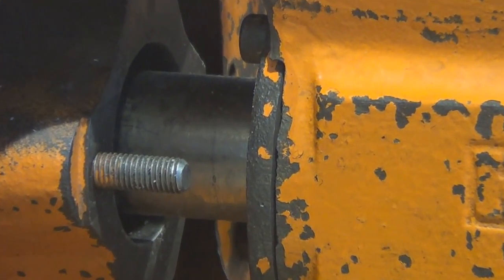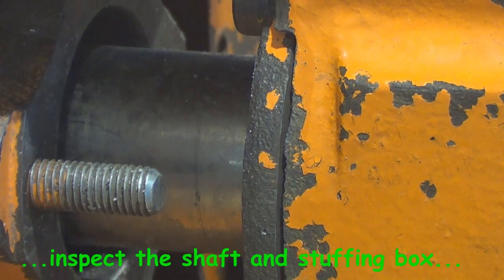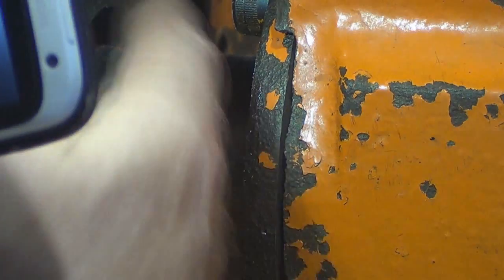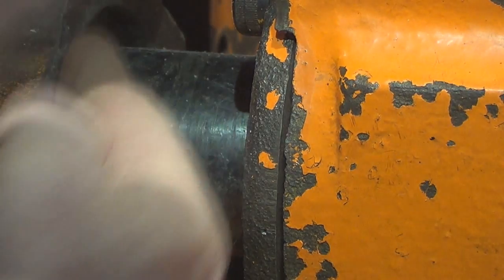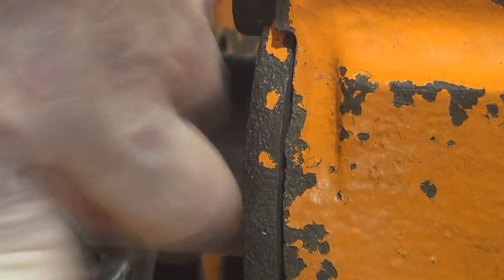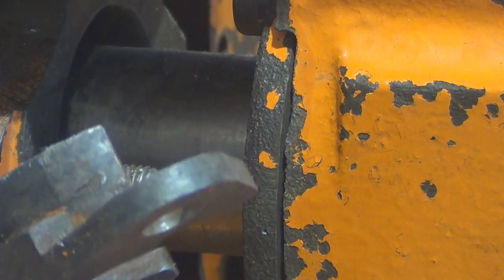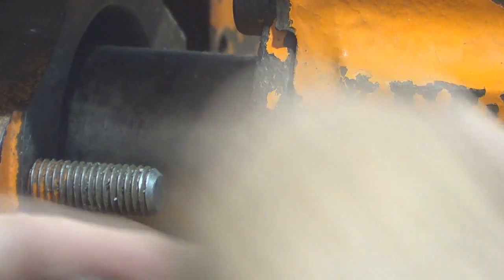It's also important, once you have cleaned out the stuffing box, to check the shaft and stuffing box for any damage. It's a little difficult with the shaft in position like that — if the pump was stripped down it would be much easier — but any deep scoring or grooves in the shaft would still be pretty visible from here. Everything looks all right in this instance so we can go ahead with packing the gland.